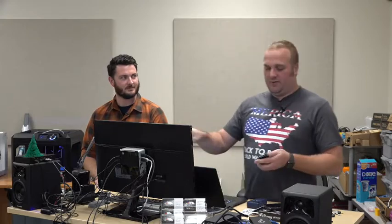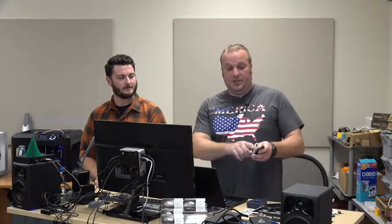With these 125 kilohertz, you have to get it right on the actual ring. The antenna spot is super important. With the plastic cards, they can just sit right on it. With John's readers on the doors, certain readers you have to hold it just right to get it to read. And then he's got a pad on the TechKnow door here, and pretty much if you come within 6 inches of it, it unlocks the door.